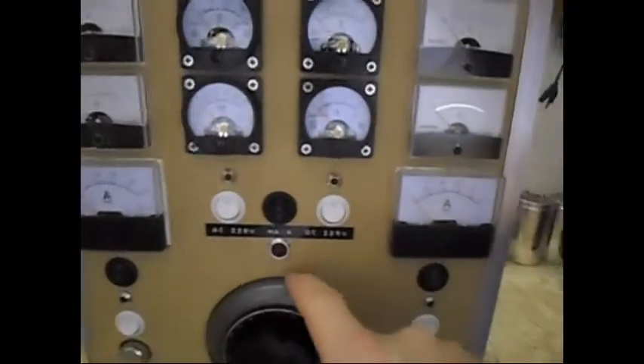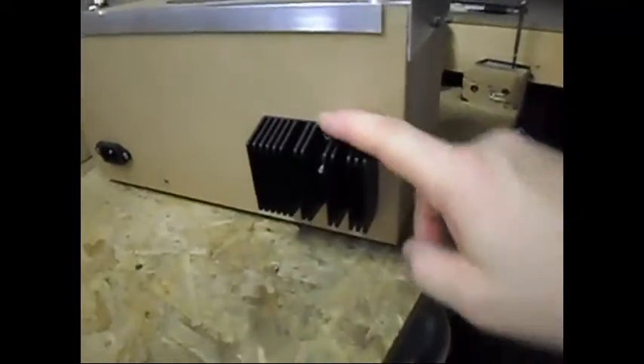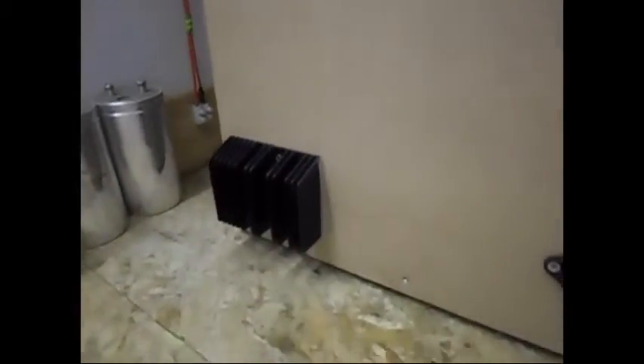I have in there also two bridge rectifiers. On the back there is the input and of course a heatsink for the rectifier. Same goes for this side — input and the heatsink on the outside for the rectifier. But the heatsink doesn't get hot at all, because like I said I normally don't go beyond 50 or 60 watts.